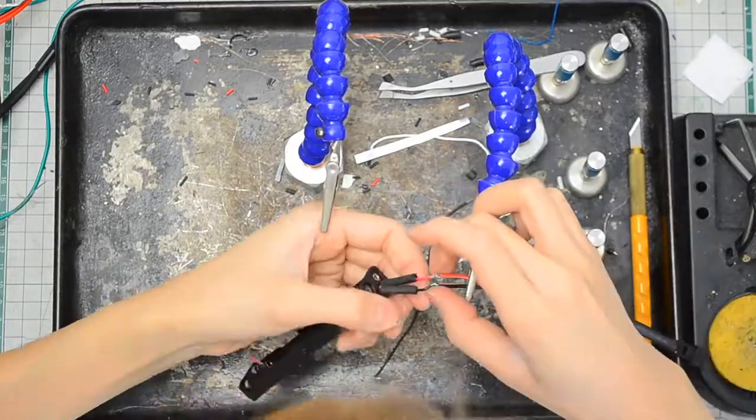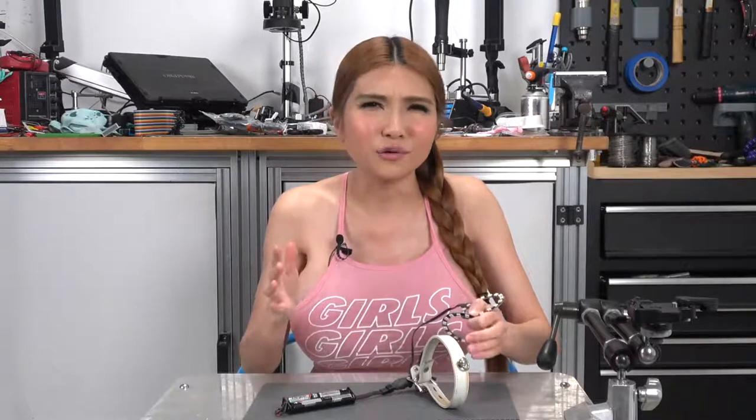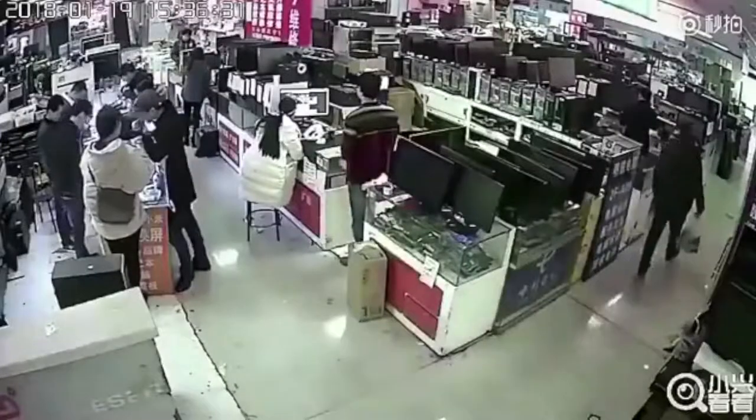That's my LED Pastel rings — not really practical to manufacture in their current form. You've seen me put them together in a past video: there's a lot of soldering, heat shrink tubing, and a large battery pack that attaches to a choker that's really not appropriate for young kids. While it's very cool looking and very bright, all together with all the parts and labor, it would probably have to sell for almost $40 or $50, and that's just no fun — most parents can't afford that. Some things are only fun if they're cheap, and this is one of them. Keeping this affordable is probably the most important design constraint. The next is power: most wearable LED designs use LiPo batteries. I won't do it — the failure mode for LiPo batteries is to explode and burst into flames. I'm not strapping an unshielded one to a kid's head. That means button batteries, like the CR2032, are our next best option. That's really going to limit our power output, but it should still be more than enough.